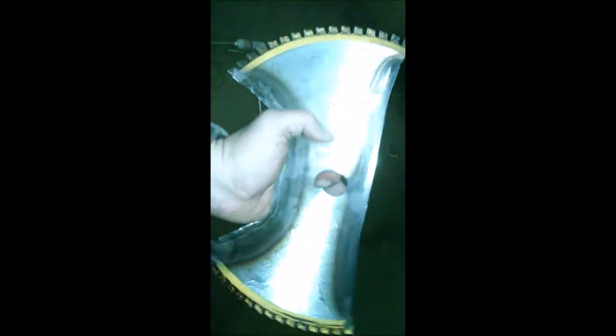I've got the basic shape of the axe cut out. You can still hear the grinder going in the background. I tried to sharpen the tips but I ran into one small issue — it's diamond-tipped. The grinder just wasn't going through it; it's such a hard type of steel for cutting through concrete. The grinder is just eating the disc up and not doing anything to the ends. I really don't want to take the temper out of it, because if the ends are that hard and the center is soft, when I smack into something it'll flex more than bend or break — so I'll take that.